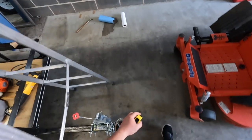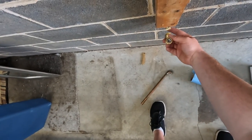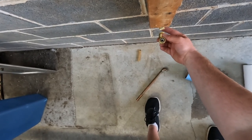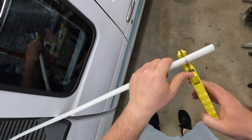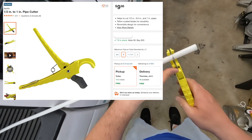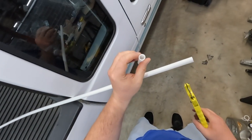One of the advantages with the old setup was we could make this 90-degree turn closer to the wall. With the SharkBite setup I have to add a small piece of PEX to connect the sillcock to the 90-degree fitting, which makes this setup stick out about two inches further. I got this PEX cutting tool at Home Depot for $10 and I'll leave a link to a similar cutter in the description.